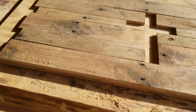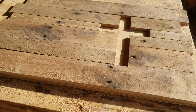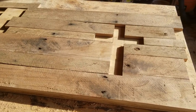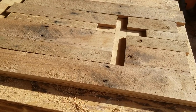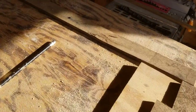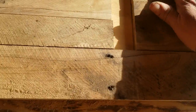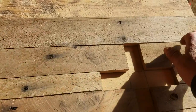I'll sand it down real good and try to get all the stains out of it. I have about five orders for these right now. This is a nice easy project — I'm going to stain it, put a bible verse on it, polyurethane over top of it. Since this is the front, I'm going to flip the whole thing over, line it up just the way it is, and make some slats. I'll rip that in half — probably three pieces — and go about half an inch from the top, half an inch from the bottom, and screw that into the back to keep the boards from wiggling.